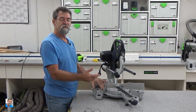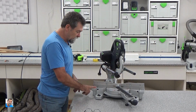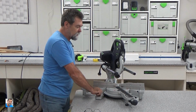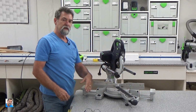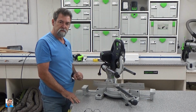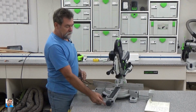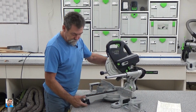The saw rotating table, I've told you, goes to 61 degrees on the right hand side, 60 degrees on the left. It also has these extension wings. Now down the bottom here, there are a couple of clamps. So I can extend it out to give the timber a little bit more support if I'm cutting smaller stuff. Obviously, if I'm cutting larger stuff, I'd want to set it up on the stand, or I'd want to do what I'm going to show you in a couple of minutes. Out at the front here, you may see that there's a little leg coming down under there.